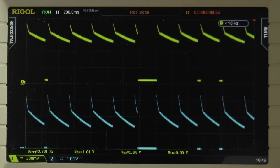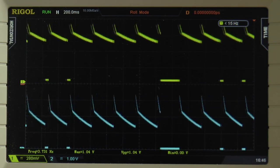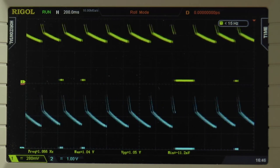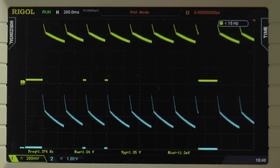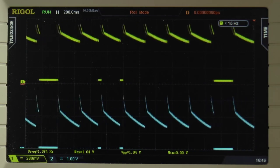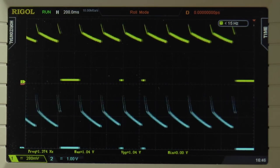So I've got two caps on the breadboard right now. I've experimented with a lot of different ones. You can also do the same yourself. I found from my experiments that 2.2 microfarads across the base of the transistor pretty much eliminates all but the most extreme clicking and popping. So we're going to throw that in first and look at the wave shape up here.